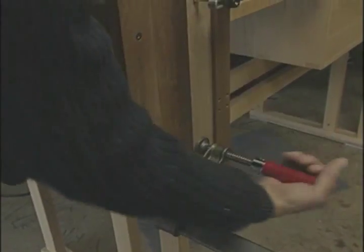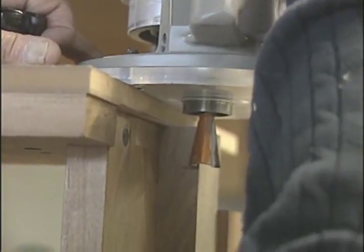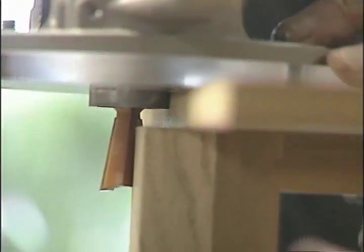My rough red scribe line will be my first guess at the depth of cut. Test this on scrap first. A big router for a big cut. It may not seem like much, but there's a lot of waste for this much cutter extension.